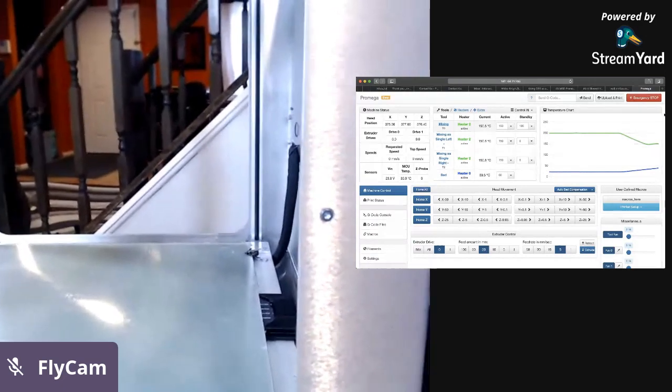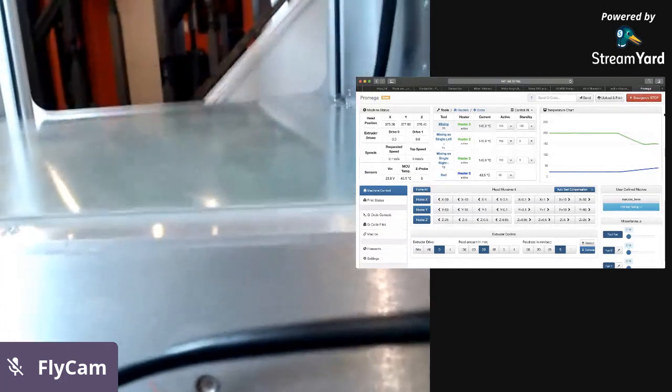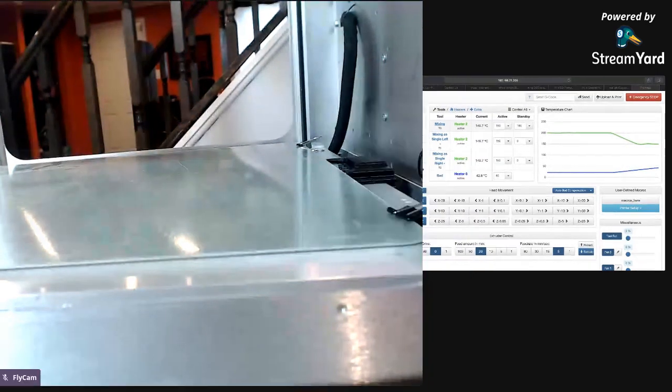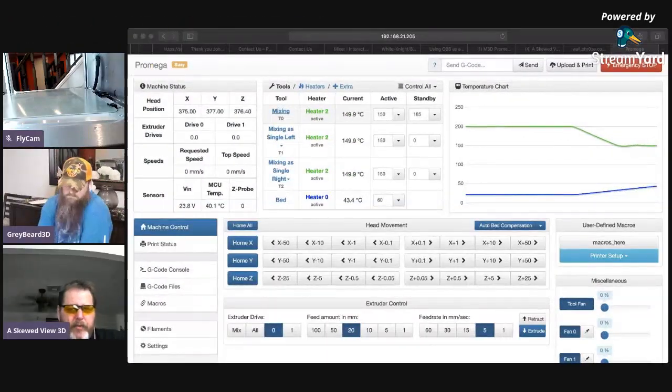This is PLA you're going to print? Yeah. What do you normally print your PLA at? I normally print PLA at about 210. I usually do 215 and 55. Yeah. Although after talking with you and hooking up that tornado with the mosquito hot end, I do the 220. Yeah. We'll just wait for that to heat.